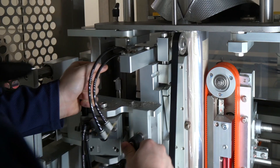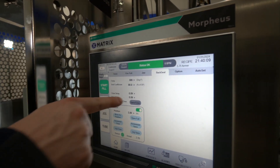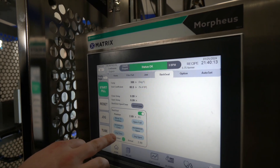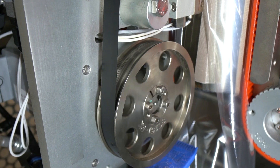Left to right has been aligned, so I'm going to reattach. With the button still in the closed position — so the bar is still in the closed position — I'm going to bring this vertical seal bar in until the band stops moving.